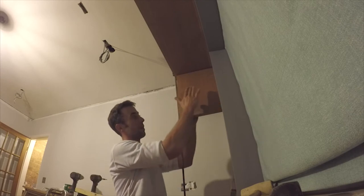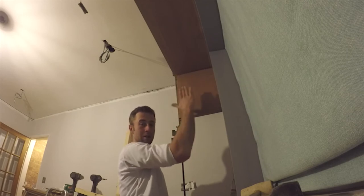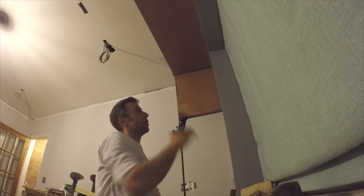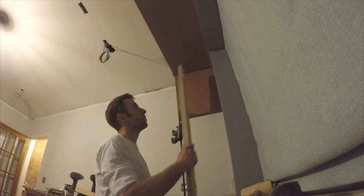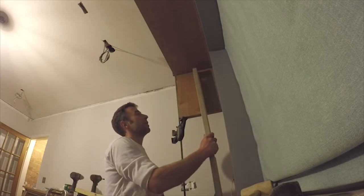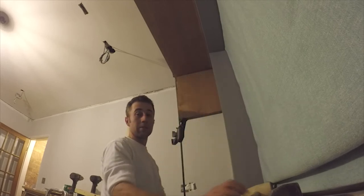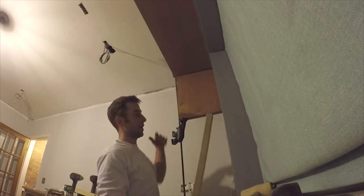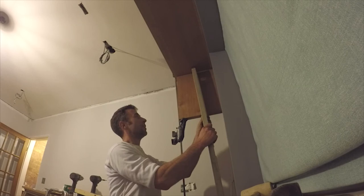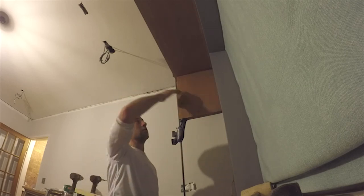The other good thing about having a pin, just one in the middle there, is it means I can pivot this one that way to get it right vertical. So I've slotted it on, and that's all same as per the last shelf. Spirit level up against it there, and then I can make an adjustment. Just a few little taps, nice and easy. Obviously whilst clamping this, a big clamp helps, and just check that, and that looks good. Spot on. So then I'll go to the top to attach this to this.